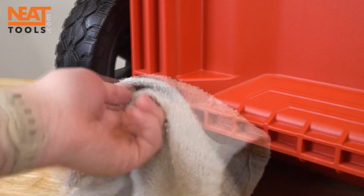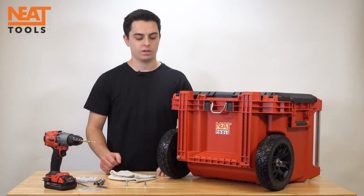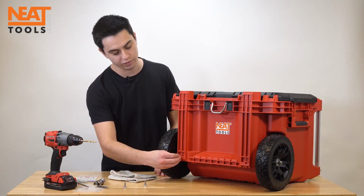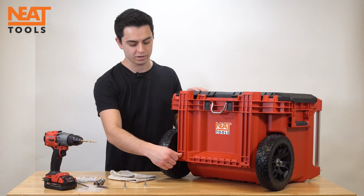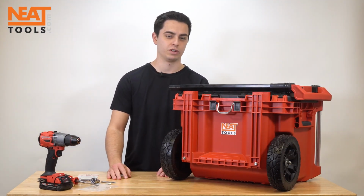It's important to not use any pliers to screw in the pins, as you could damage them. If the thread is still too tight, remove the pin and again use the M6 1 bolt, screwing it in and out a few times to hone out the threads a bit more. Once both pins have been properly installed, we'll move on to step four, which is reinserting the handle.